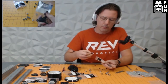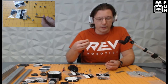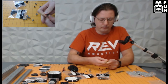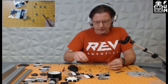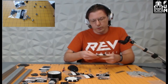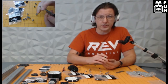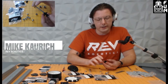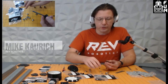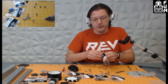We'll use the longer ones a little bit later, but the short ones work really well inside the channel. There's a nine-millimeter bearing seat that happens every 16 millimeters down the channel itself. We get that put on our hex shaft — these bearings fit on the shaft nice and snug. After that, we put on a three-millimeter spacer for standoff. Since this is a chain drive, we're using sprockets. One of the nice things about our Delrin motion components — whether sprockets, gears, or pulleys — is they're nominally 15 millimeters wide, so you can swap them in and out. We set up the single sprocket and use 15-millimeter spacers to fill the next spot.